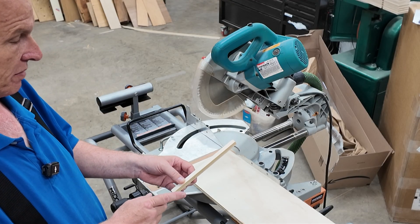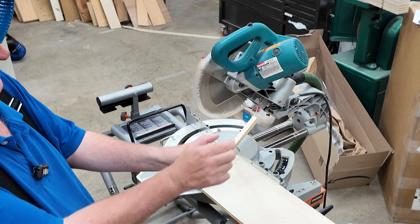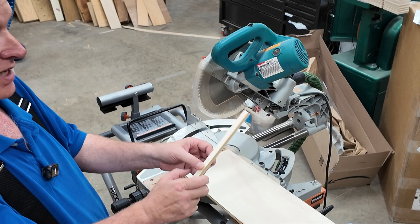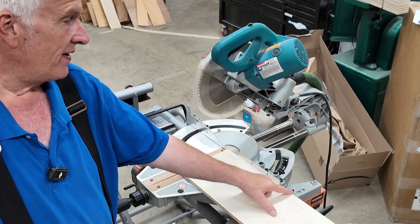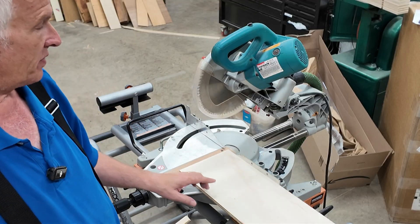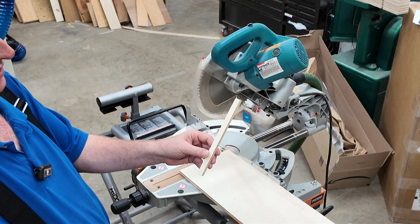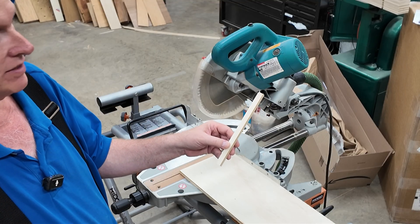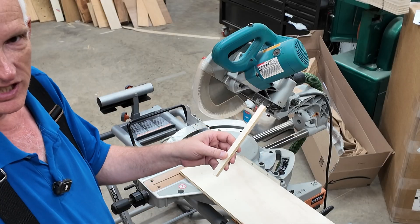The technique here is to measure the width of this piece of wood at each end. If the width is the same, then the cut is square — on the condition that the edge of the board against the fence is straight and the fence is straight. The difference in the width at the two ends will give you an indication of how accurately the saw is tuned up.